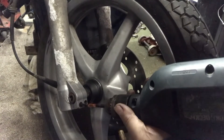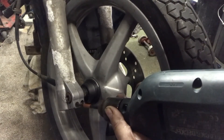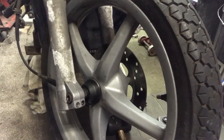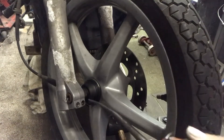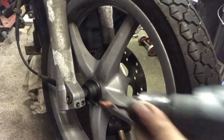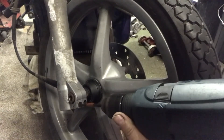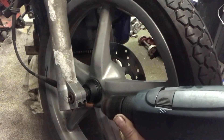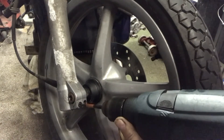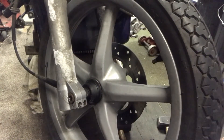Let's drill this out. Nice and steady. A little bit of oil on that - normal oil is fine. What I'm going to probably have to do, because that's quite a hardened steel allen key bolt, is pause later and resharpen some of these drills. Let's start the process, let's get this allen key bolt out. Nice and slow - you don't want it fast. That's going nicely. I'm going to crack on and we'll come back once I've got this bolt drilled out.